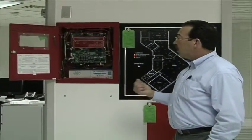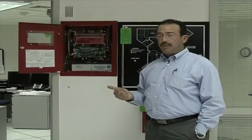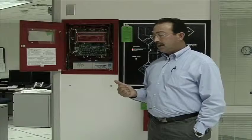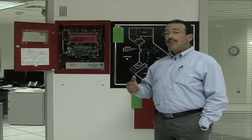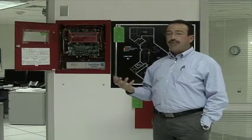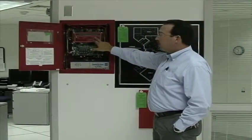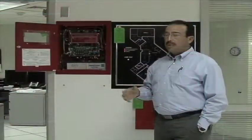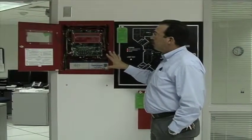Okay? So I'm just going to go ahead and recap. If we have a smoke detector in any of the protected zones, first alarm, you're going to get a bell. If you have migration of smoke to a second detector, you're going to get a horn strobe. Okay? Within 60 seconds of the delay, you're then going to have a release. The horn strobes inside will still be sounding, but the release strobes outside the protected areas will be flashing as well. Okay? So if I want to silence the system, I'm going to press acknowledge, and then I'm going to press silence, and all that's going to do is silence the audibles, but it's not going to keep the gas from discharging. Okay? That's pretty much all the controls here.